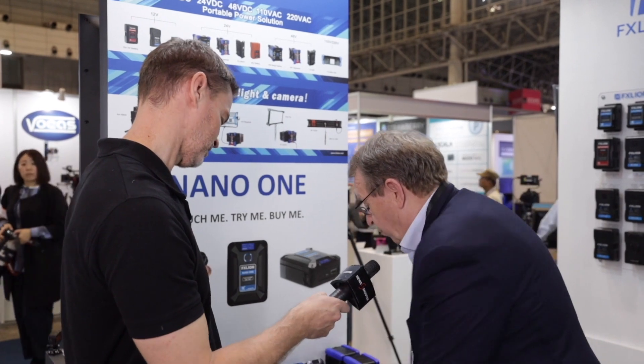We have now two new plates. We have two plates for NPF battery, and we find out in the market that some NPF accessories like monitors or data transmission for video and similar devices are sometimes using two different systems. Most professional monitors are using a voltage range of 11 volts to 16 or 24. We make an adapter where you put the nano battery on it and you get on the NPF adapter 14.8 volts.